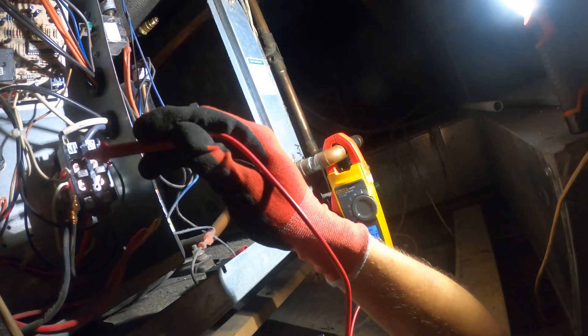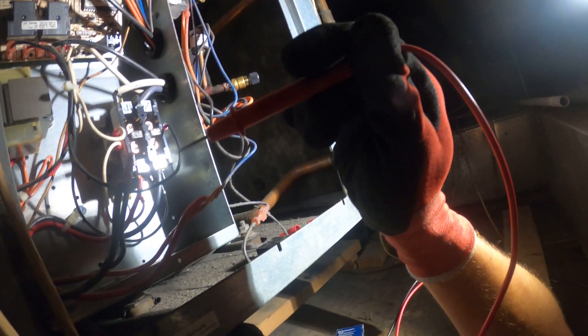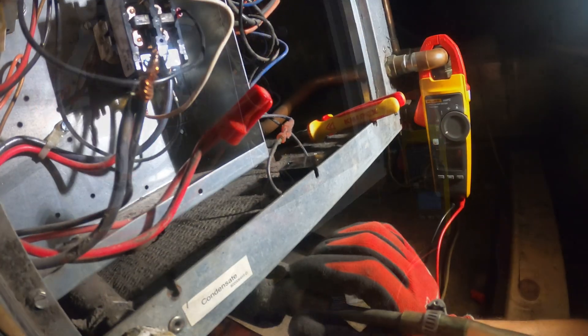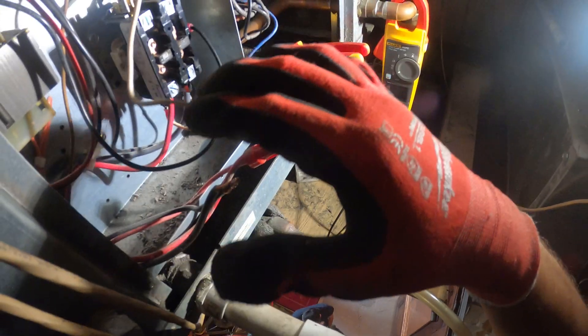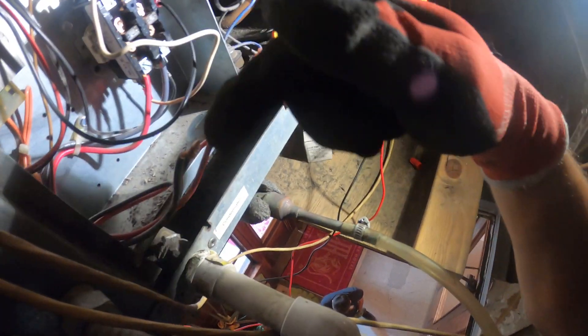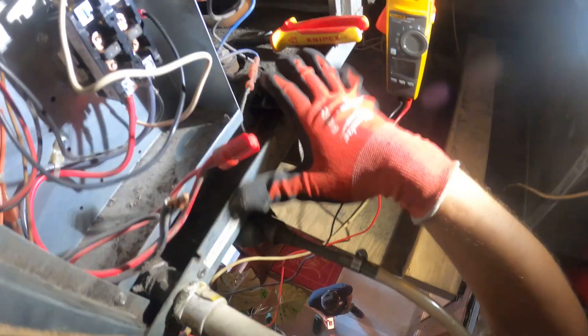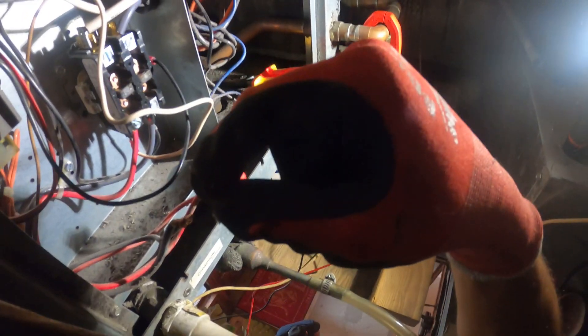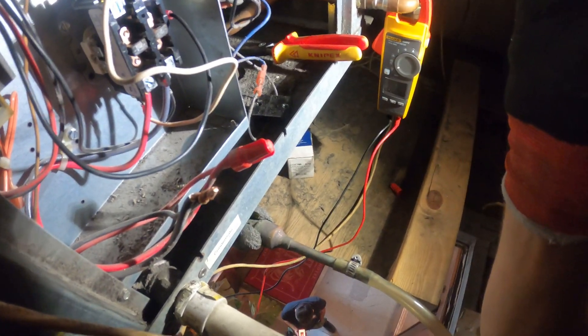Going across these two we get our 208, so I need to put the white wires to the other side of the line voltage coming in — that should energize this contactor. The other side of the coil is coming from the same source, so we need to move it to the other leg. Between one side of the coil and this wire we have 208, but between both coil sides coming from the same source it's zero — they're on the same line. We just need to put the other side of the coil to line 2. Only one side is always alive; when the compressor calls it will send the other 120 through that leg and energize the coil.